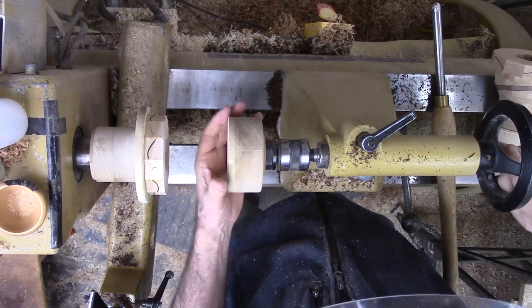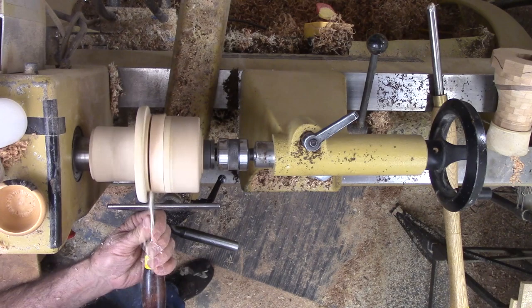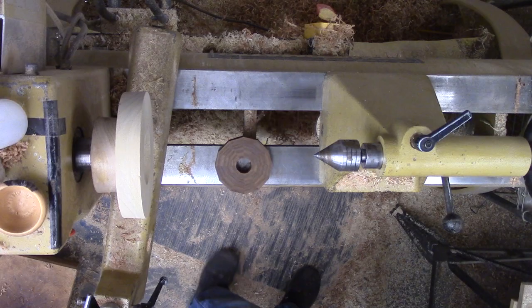Then press together. Now I can split the ring on my lathe with my usual parting tool. When almost through, I loosen the tailstock to prevent binding when it finally cuts through. Now I have two maple rings already mounted and already centered. Back over at the metal lathe to face off the slightly rough parted surface. The alternative is to do the same task at the wood lathe, but this is quicker and easier. While at the metal lathe, swap faceplates for the other part of the maple ring, then face it off also in preparation for the next task.